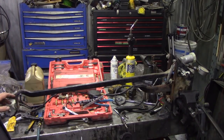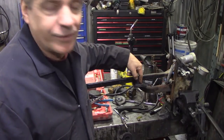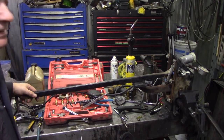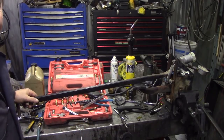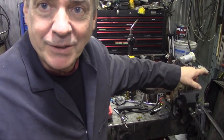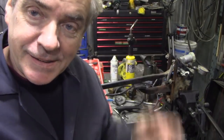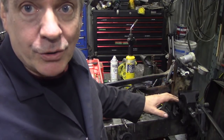I've got a big pry bar in here with a spanner acting like a pivot, pushing on the pedal. If I was to press down on here, because it's locked up, because there's nowhere for the fluid to go, I can exert a lot of pressure. Have a look at the gauge. I can't work out for the life of me how much pressure should be on the pedal, because there's nowhere for the fluid to move. So we're going to get a big reading.